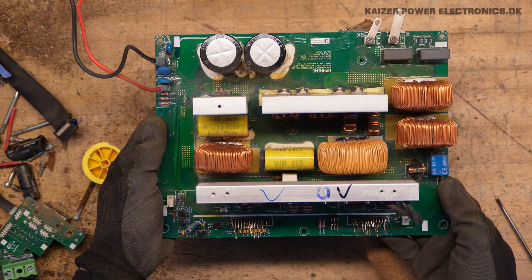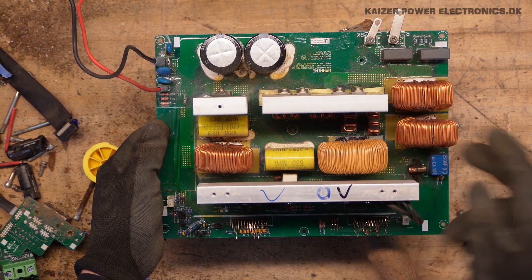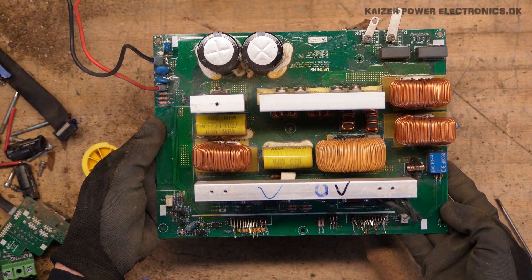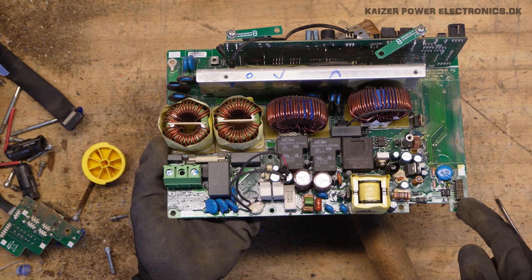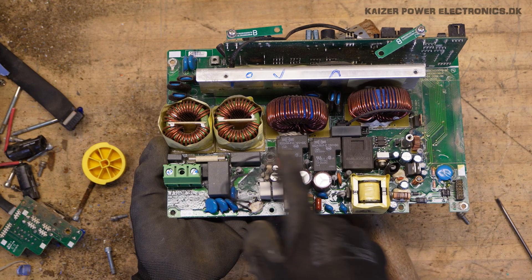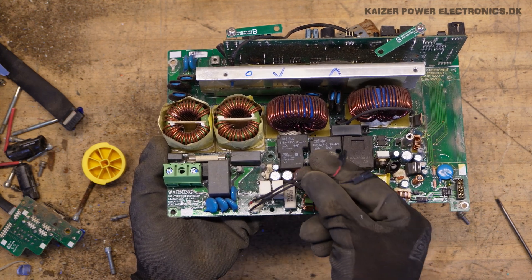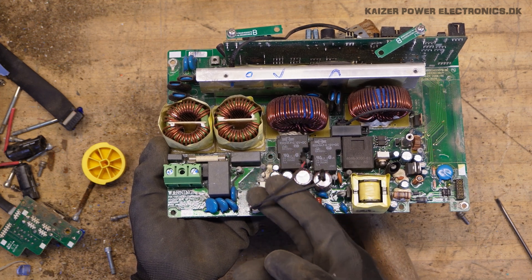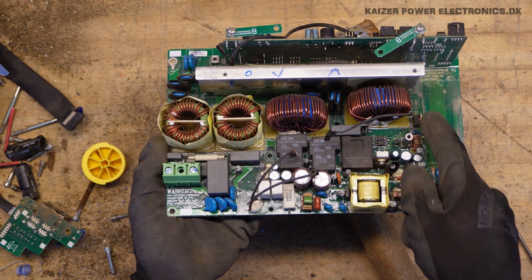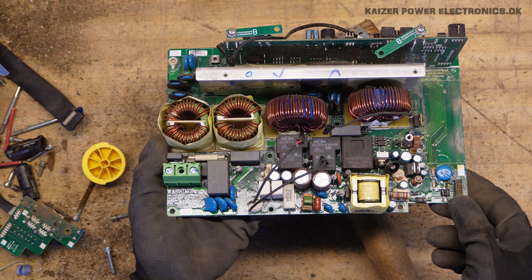Not much to say from the layout here — we have a lot of inductance sitting here and some most likely snubber capacitors to prevent any DC saturation of the transformers. That could be our isolation transformer. Again, this is only a 2kW inverter, so components are not that big. Over here we have the communication module plugging into the board, which tells us that the display and the Modbus communicates with this card. We have relays for switching on and off the mains connection, and filtering for the mains connection. These two connectors went up to the two photovoltaic links to measure the voltage, and there's a single wire which also went to the voltage string with a series of resistors — most likely the high voltage sensing and possibly an earth fault sensing circuit for the panels.